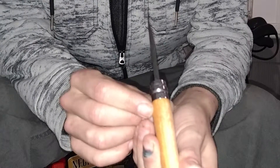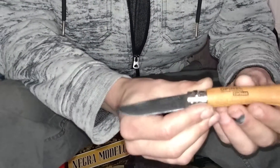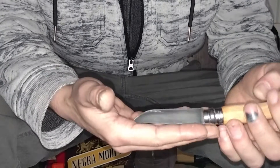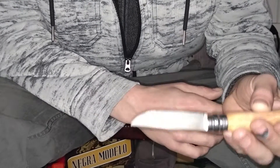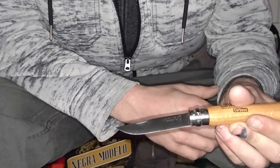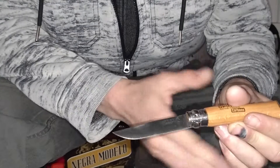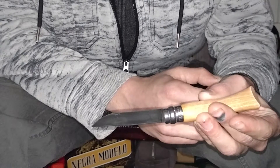Probably can't see that. Maybe you can. But yeah, as you can see, I acid washed or etched the blade. Used some vinegar, some hot vinegar — warmed up some vinegar. That's what you got. Nice and dark, kind of protects the blade a little bit. You've got to watch out wherever the surface of the vinegar meets the air and whatnot, where the blade sticks out. You'll get some rust building up there, so you have to sand that off.